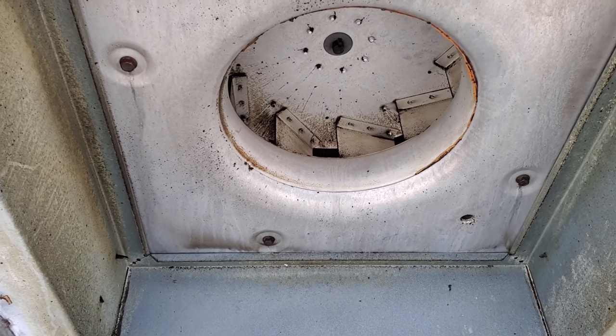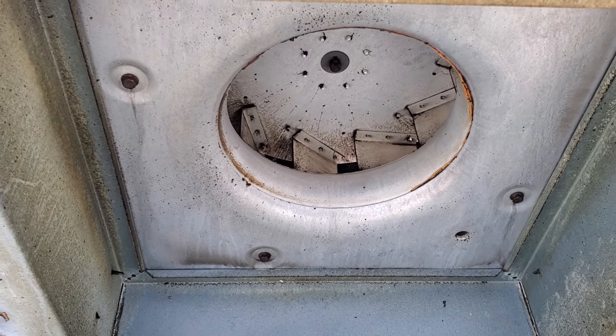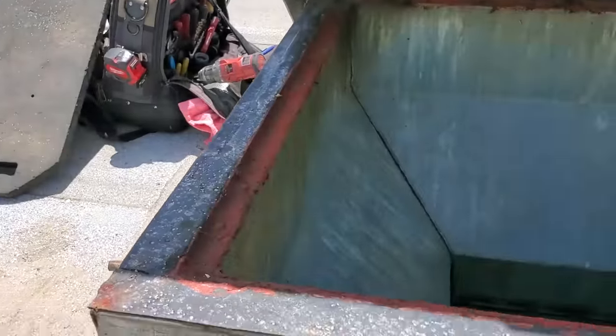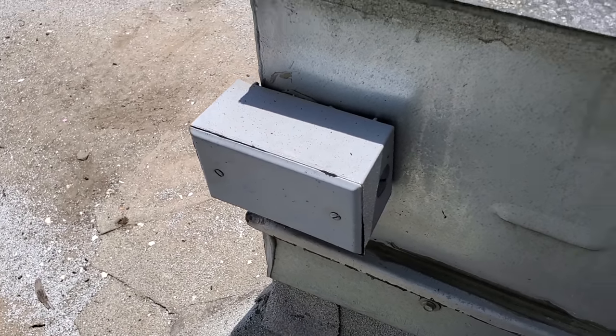I'll warn them that if they don't get this taken care of ASAP, they're going to have another bad switch, if not more damage soon. And when we do that, we'll definitely redo that electrical box, redo the conduit, all new wire because there's some corrosion inside there, put new gaskets on them — all that good stuff.